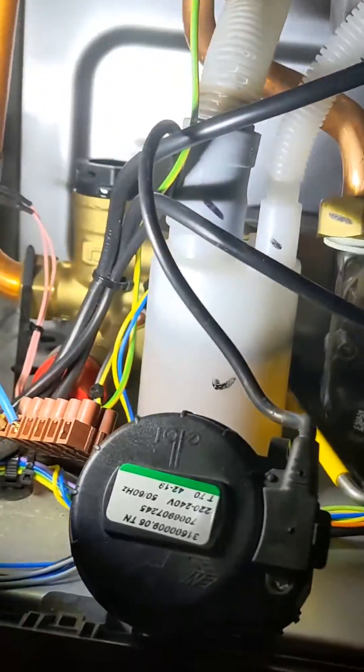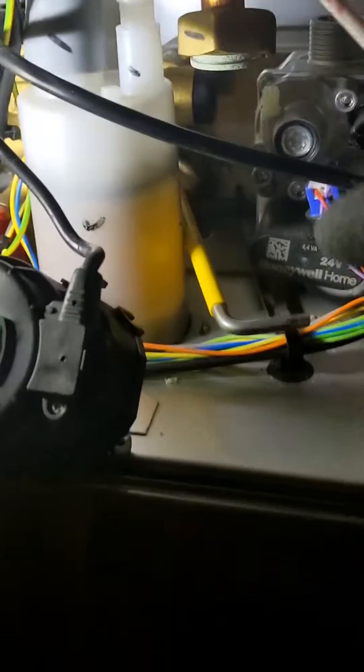The left-hand side screw is actually right behind the condensate strap. So you can either pop the condensate strap out, or use a ball-end hex key so you can get into there and tighten it at an angle as well. That's nice and tight now.